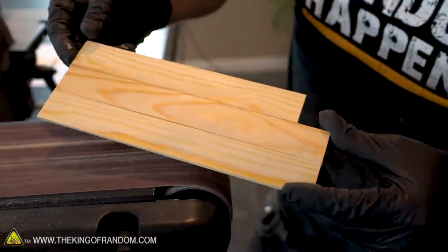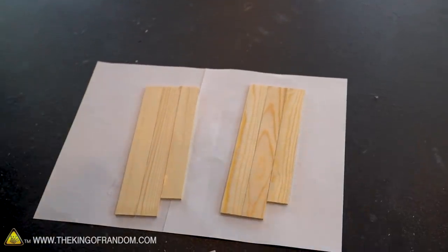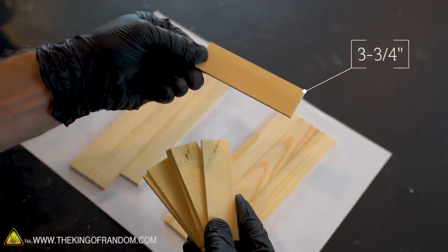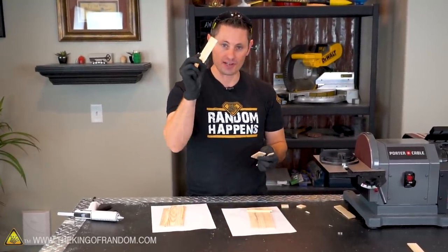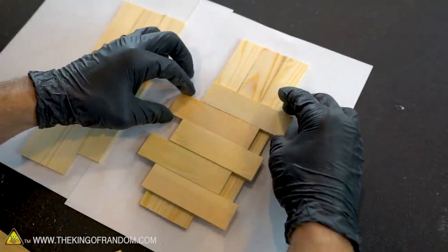We got these things glued together and sanded — they're looking great. Now we're going to flip them over so the smooth side is facing up, mark free. We're going to get these eight pieces cut to three-and-three-quarters of an inch. These are going to be our strappings for the box, and we're going to glue them into place. We can actually use the paint sticks themselves as spacers to make them look very tightly spaced.